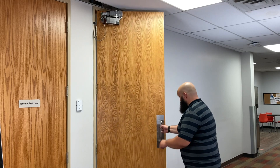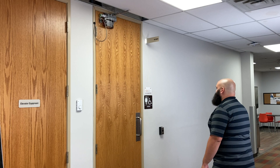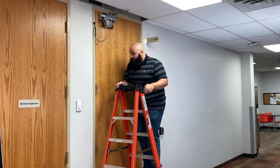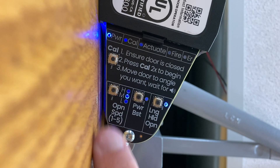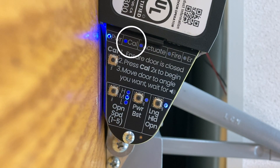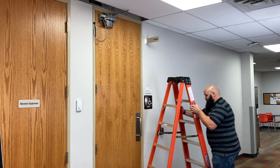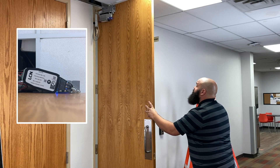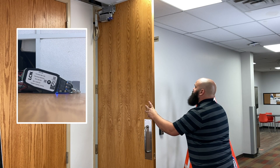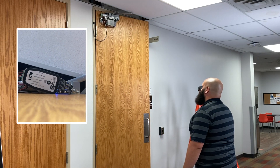The compact operator must be calibrated before programming. First, open the door, release, and observe the closing. Make adjustments to the closer as necessary. With the door fully closed, press the cowl button twice. You should hear the operator beep twice and see the cowl light blinking blue. Open the door to your preferred fully open position — it should be between 70 and 110 degrees, and at least a half inch from a wall or stop. Hold the door here until you hear a beep. The cowl light should now be a solid blue. Calibration is complete.